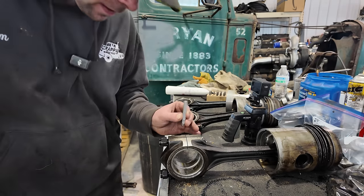I'm blowing from the bottom up trying to keep the crankshaft clean — holding my finger over the oil hole on the rod journal and blowing all the dirt out the top. Number one was by far the worst, with dirt packed in around the coolant tube that runs the whole length of the block. I think they never really used antifreeze — they'd put water from the local creek in every day, drain it in the wintertime, and refill the next day. This is the consequence: a ton of dirt and sediment in the whole cooling system. At least this way we're getting everything relatively cleaned out.